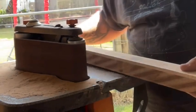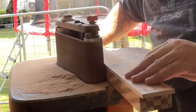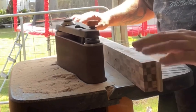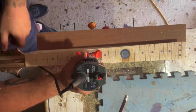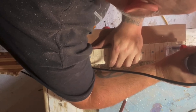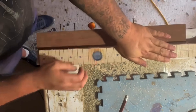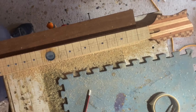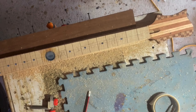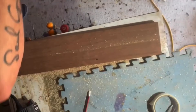With that template it'd be better on a router table because I tend to dip — I can't keep a router flat to save my life. I've got a plate on my bigger routers but I do have a table set up, and hopefully I'll use it properly because last time it vibrated so much it made me cut deeper. I'm cutting a channel with the bearing bit that comes with the router — it's fine for straight sections but for curved sections you've really got to have it lined up, otherwise it'll cut too deep or too shallow.